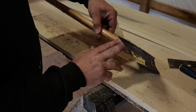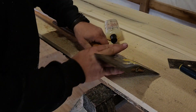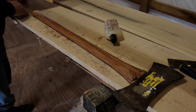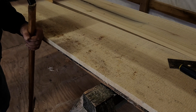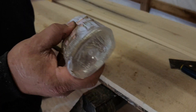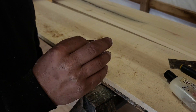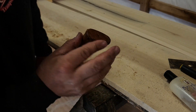If it has varnish on it, it just won't soak the oil up. Then it seems like eventually your handles will dry up and start cracking and splitting. You can get some in the top here — that's good too; it can be a little difficult to get in there sometimes. Just rub it down good, get some on the butt of it. I think the end grains are especially important. The wood is made up of fibers that are kind of like straws — they'll soak in oil to keep the moisture out, which will nourish the wood and keep it going for a long time.